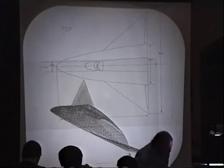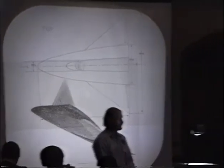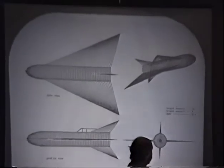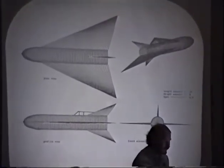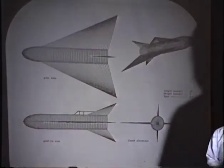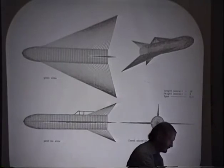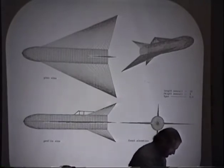Dozens of small tanks inside tied it to the fuselage shape. Complex compound curves on the upper surface. And we just got to the point where it wasn't possible for home builders to really do it. So we went with the wing version. Started with the delta wing design that, as you can see, the wireframe drawn here I used for aerodynamic studies. This one has pretty good characteristics until I started doing CG analysis and stability characteristics and found it had this nasty tendency of trying to swap ends in flight. It wanted to fly backwards. So we couldn't use that one.